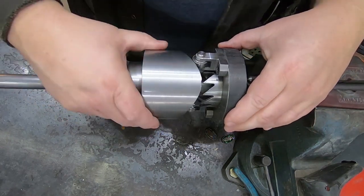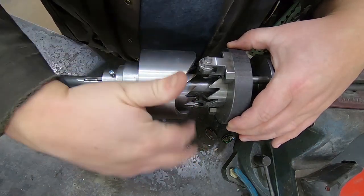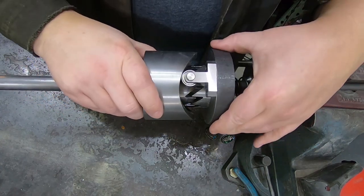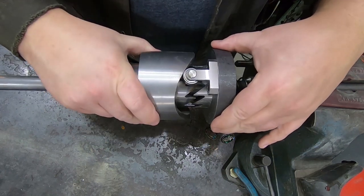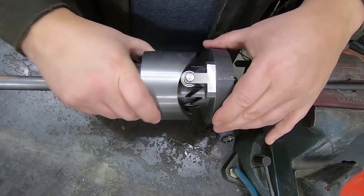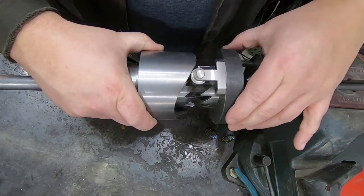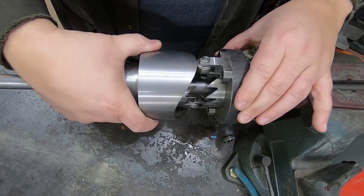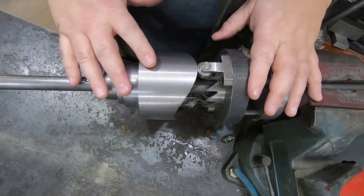So my first thought of doing that was this cylindrical cam here, which was a lot of fun to make, and I think fairly gorgeous, but it doesn't work that well for two reasons. One, as it tries to push it up here, the slope is just too steep and it jams if there's any back pressure, and there needs to be back pressure from a spring here. And the other big problem is that because it's on opposites, this actually wants to roll downhill whenever it jumps out of this detent, and that's bad. So I have to unfortunately give up on this idea.